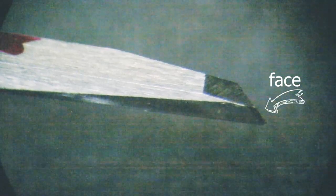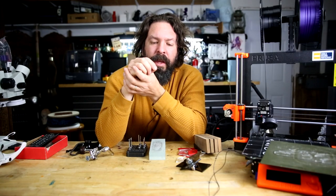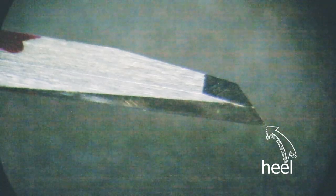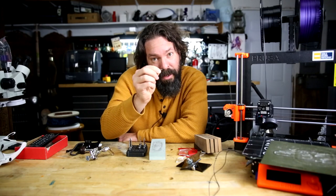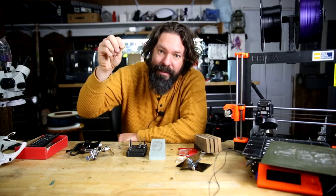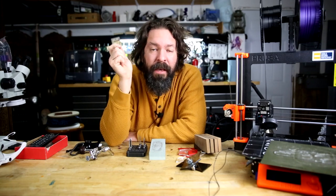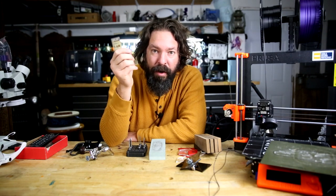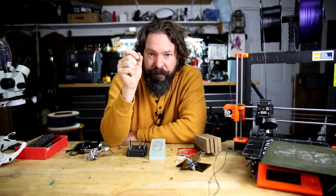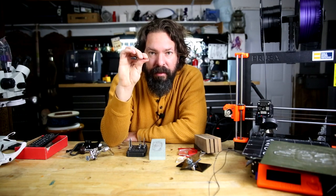The most basic thing you need to know as a beginner is that gravers have what's called a heel. Let's look at this graver up close. You can see at the front an angled face — that's what you'd typically think of on a wood chisel, and it allows you to dig into the surface. But the important bit is the heel, down at the very bottom. The heel allows you, when you dig into the surface, to drop that angle down and travel along the surface or even come back out. Without it, your graver would just keep digging deeper and deeper. A heel is extremely important and we'll get to how to sharpen it in a moment.